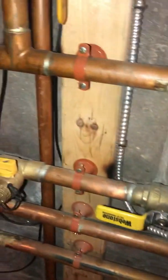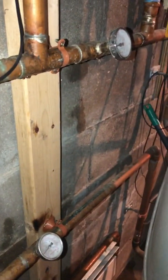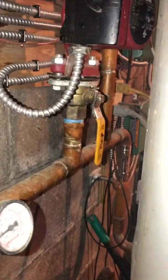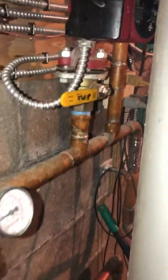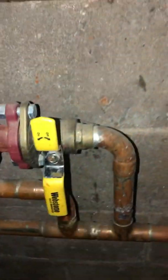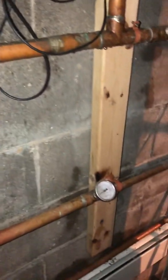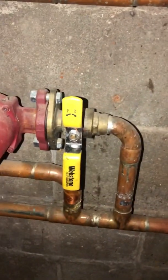Done flushing the vinegar out of the flat plates — return the valves to their normal operating positions. One thing I should mention: on my heat exchanger I'm using a monoflow T, which is like a primary-secondary loop. If you have any secondary loops, from flushing it's going to have a little air in. You're going to want to turn the valve off to the pump — this is my furnace secondary loop, and that's my snow melt secondary loop — before you restart the circulation. If you don't, any air displaced out of a secondary loop could find its way into one further downstream, and then you'll have to bleed those too.